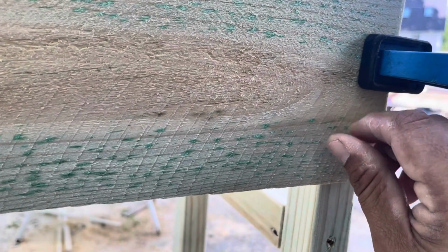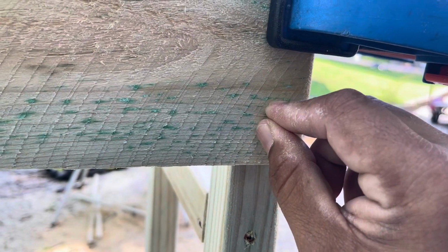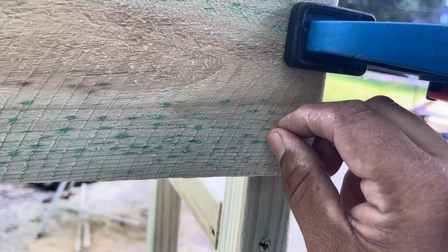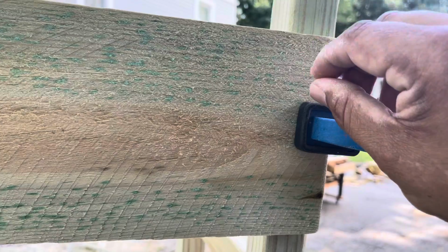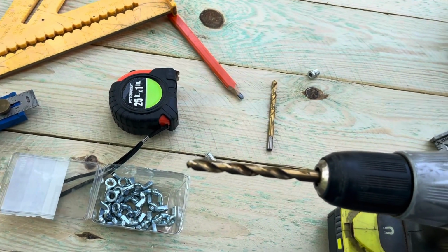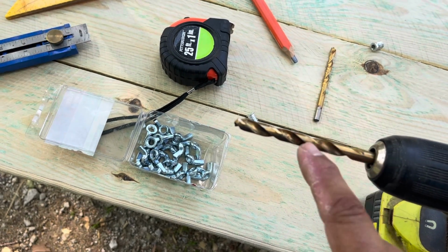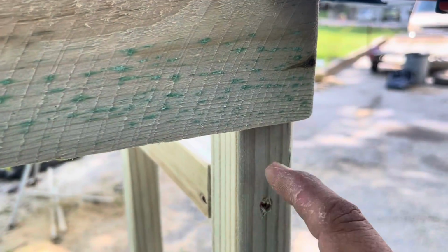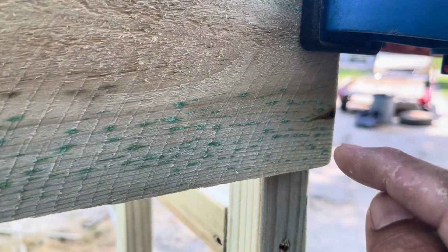It's either going to have a wing nut on it, so we might weld or solder a wing nut on top of a 1/4 inch bolt, or we'll see if we can get some little knobs. That would be ideal. Order some little quarter inch knobs. That would be preferred. But at any rate, this is just me thinking out loud here. So what we're going to do is mark our board. We'll drill this drill bit first through the wood and into this piece. We'll drill our holes, then I'll take this piece off and drill the bigger hole for the Nutsert.